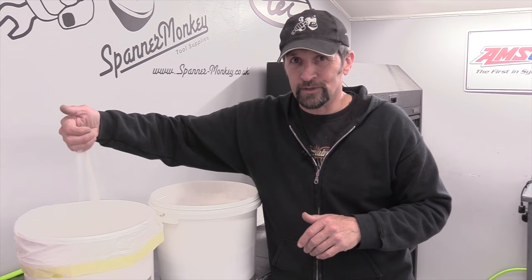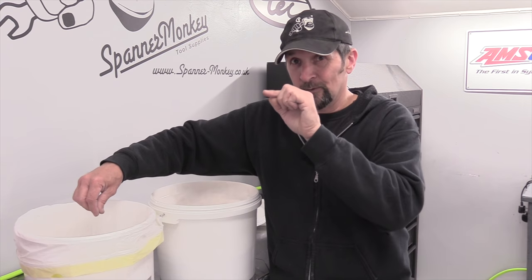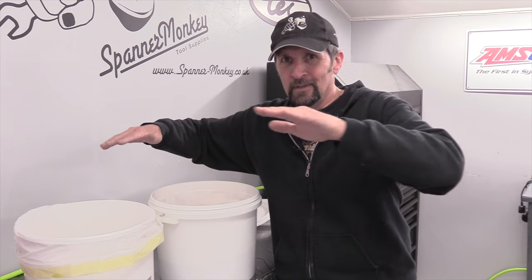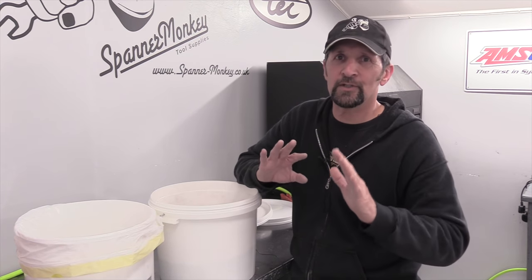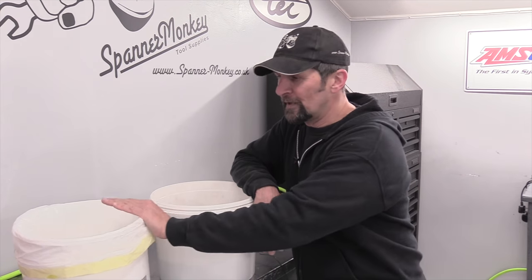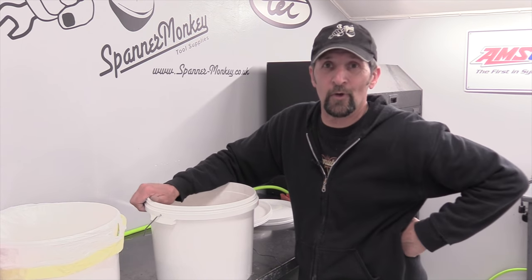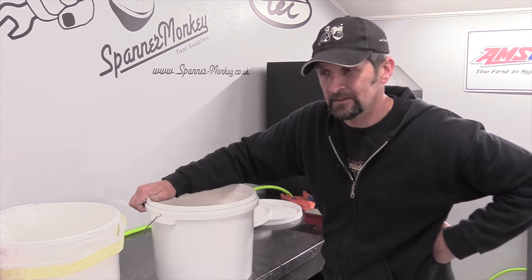Secondly I've got this — glass shot. Straightforward super fine powdered glass. It's not sharp; it's little round glass beads, microscopic, measured in microns. They're so fine that if you drop a pebble in it ripples like water. Those super fine glass beads are good for leaving a lovely satin finish on shiny surfaces without actually ripping into them. That's for a little bit later. Today I'm going to use the sand and see if I can take the rust off some of the bits in my scrap box.